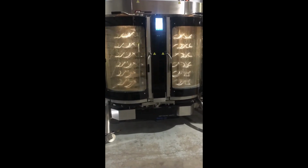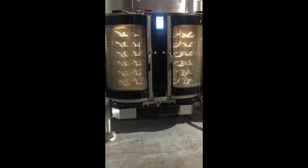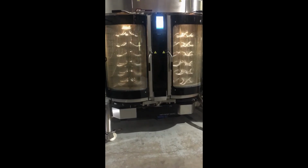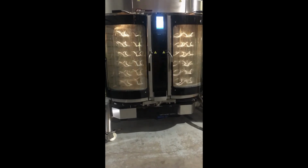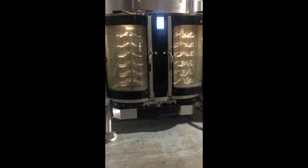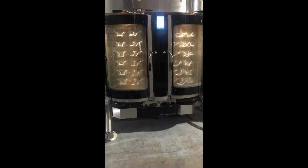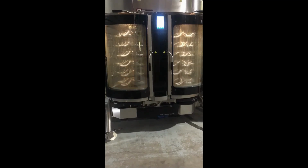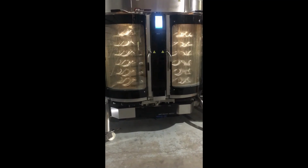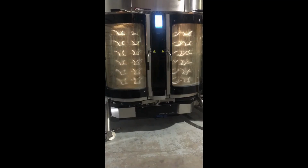After approximately 30 minutes, the oven will ask to have the fat buckets emptied and wash tablets placed in the oven chamber. The staff would normally place 3 tablets in each side, that is, finished wash tablets. After having a service, it is necessary to put in 6 wash tablets per side of the oven. After the wash tablets have been placed, you are clear to go and have the WAF signed and leave the premises.